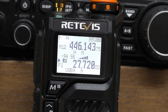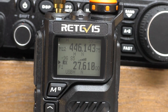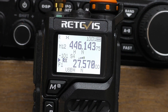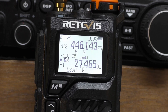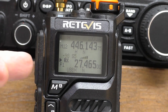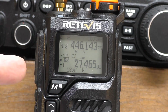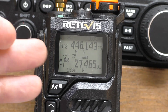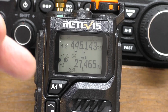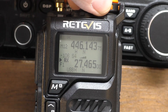We're hearing some brief exchanges on the frequency — operators confirming contacts. What seems to be happening is the radio can get quite overloaded quite quickly. I don't know if that's because it's dual sideband and it's picking up lower and upper sideband at the same time, but we're getting what we'd call bleed-over from other channels — it's not very selective. You don't get everything for 30 quid, really. It works pretty well but it can get a little bit overloaded by strong signals on a close frequency, compared to say a Yaesu or CRT 6900.